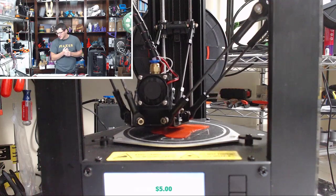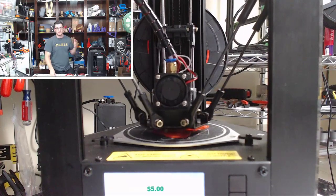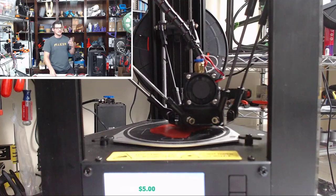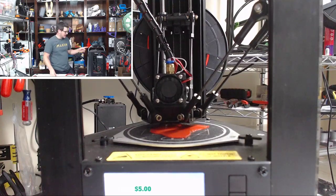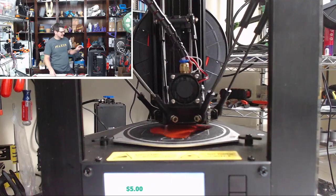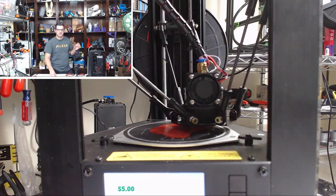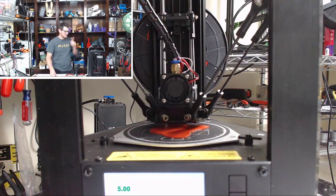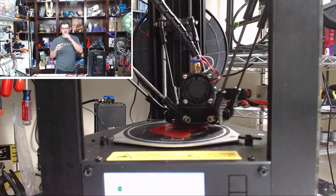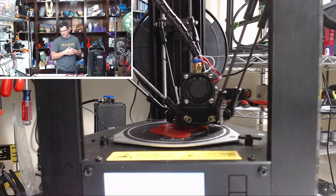Yeah, there are two videos on the Select Mini upgrades, part one and part two. Part one was done like a year ago, and then I moved, and it just got kind of sidetracked. I moved, got here, and then decided, you know what, I'm going to put the time into it, and it is printing quite well, I might say. I have to clean up the cables a little bit on it. It's a little bit messy there, but after I reprinted the parts in PLA, because the PETG was just too soft, I was able to get everything to stay a lot better. And I did have to modify the parts a little bit to make it work on the hot end, at least to what I liked.